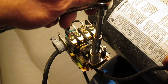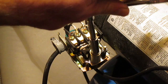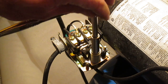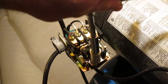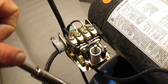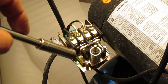That should return the jet pump to its original settings, which would be turn off at 40 psi and start at 20 psi. So there's one, two, three, and four. Now let's do our test — we'll see if our readings are now 20 psi when the pump turns on and 40 psi when the pump turns off.